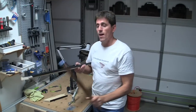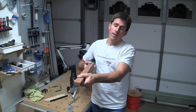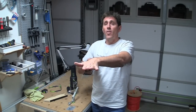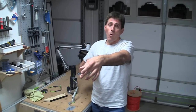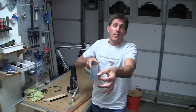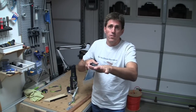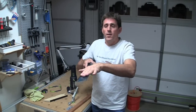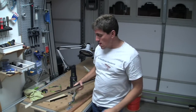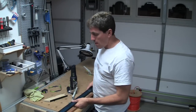What I'm going to do is use a scrap piece of sapele and put it right in the middle. When I clamp this down, I'm going to put the top fence of the domino on this scrap in order to plow the hole. This allows for any variance on the back or sides — remember, I was just clamping the beads in place and pushing them down, so it's possible one might have shifted. The point is I want this to be flush, and that's what we're going to do. Let me bring the camera in so you can see it more closely and I'll describe how it works.